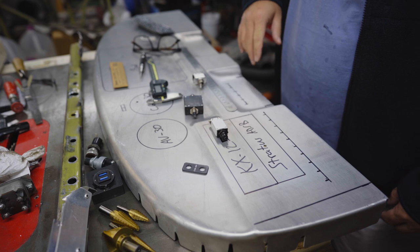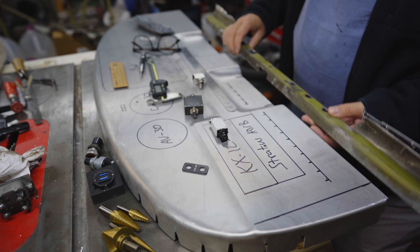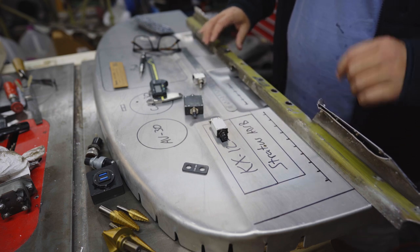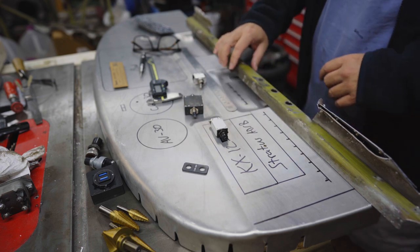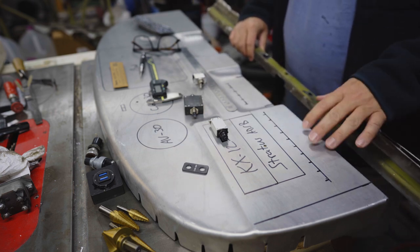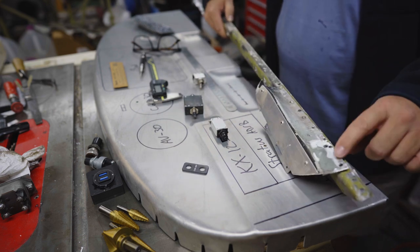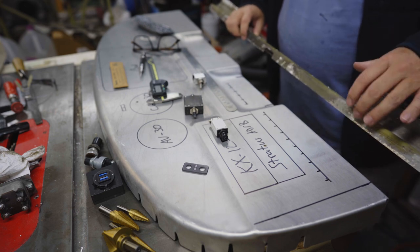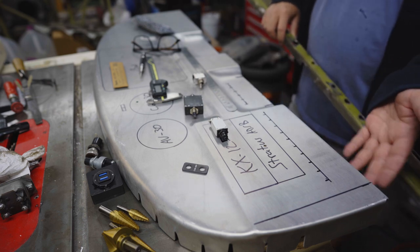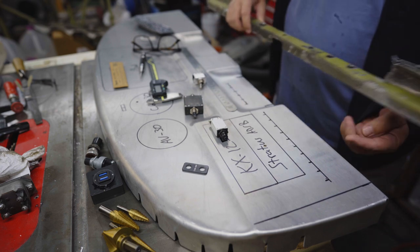So I've done some of the layout for my new panel. This C-channel is a stiffener that goes back behind here, directly underneath or behind this lower edge. And it butts up against these sunken areas. Obviously, it can't come forward and touch these raised areas. But there will be some rivets that go through this flange here on the bottom of this. There's a flange that's bent over on this area, and this area. And these two outside areas will have rivets going through into this.